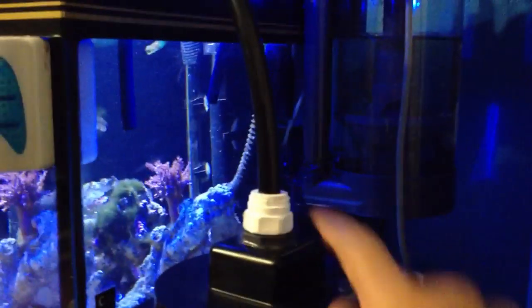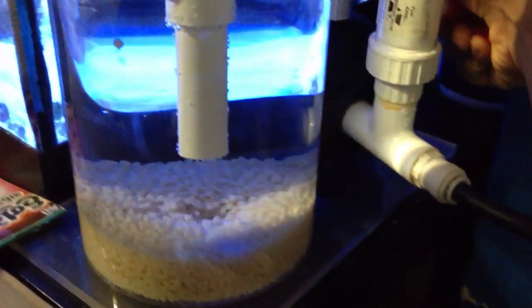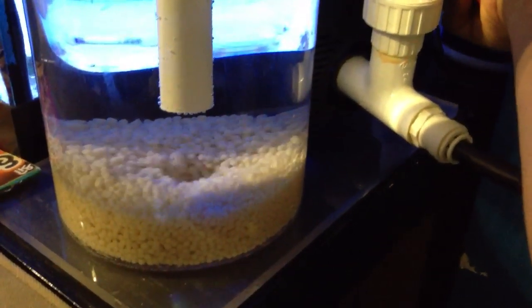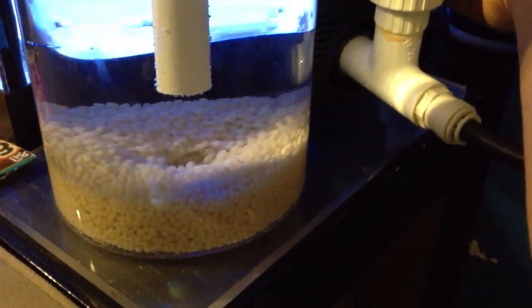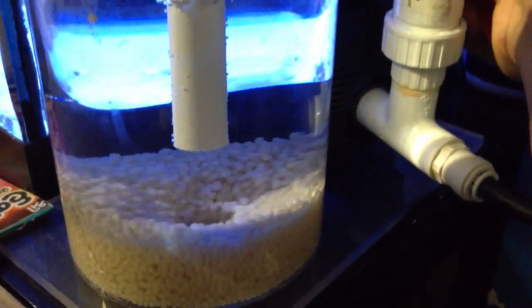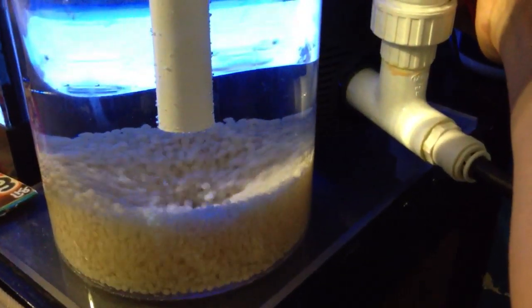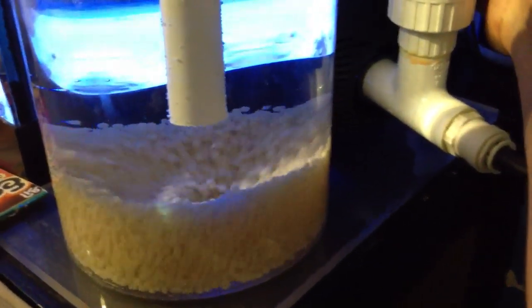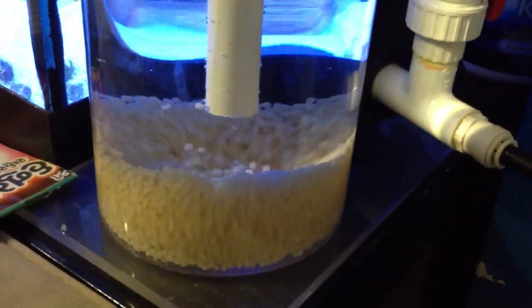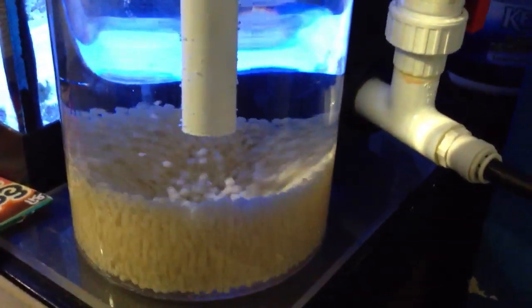The more you close the flow rate here, as you can see my sand is shifting — don't want that to happen because the output on the outside increases. So I'm going to open the valve slowly, just to give you a demo of exactly how much flow you see inside the reactor. Increasing it now — at forty percent, going up to sixty, now eighty, and a hundred percent flow rate.